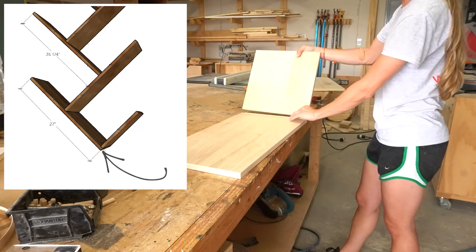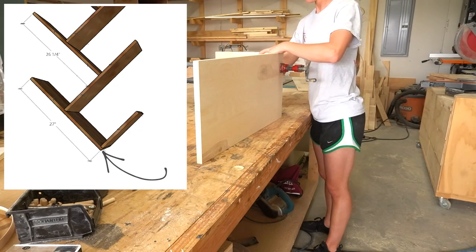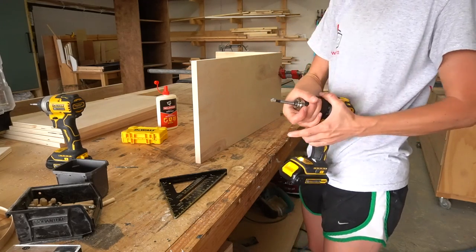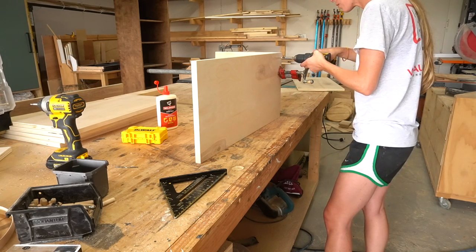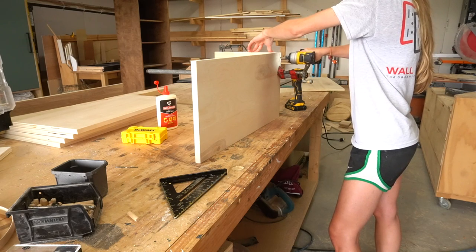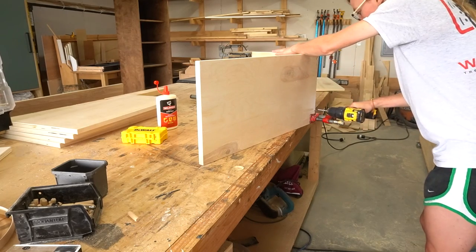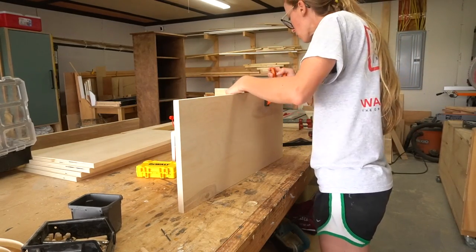The bottom shelf has a short piece on the right edge and a long shelf piece in the middle. Since it has an additional shelf piece on the end that the other shelves don't have, this piece needed to be 3/4 inch longer to keep all the shelf openings the same — so the bottom piece is 27 inches long and the rest are 26 and a quarter. I used wood glue and 2 inch wood screws to secure the short shelf piece in place, using a speed square to keep everything square. I pre-drilled a pilot hole first, then used the Forstner bit to drill a hole about a quarter inch deep for the dowel plug. I used the second short shelf piece as a spacer block to space the rest of the shelves 12 and 3/4 inches apart.